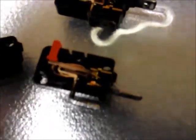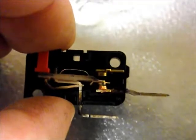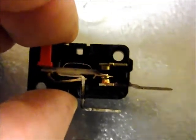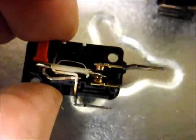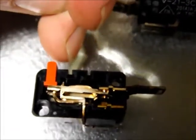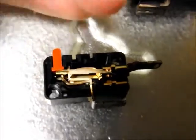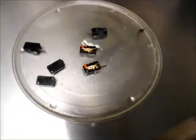So there you go — that's how a microswitch works. That's a microswitch. They can switch fairly rapidly as well, and they're very, very reliable; they don't really ever pack up. Some of these switches, as evidenced by these slots here, can have a strip of metal that comes across the switch and is hinged down — you would have seen that arrangement in a washing machine lid switch. Thanks for watching.